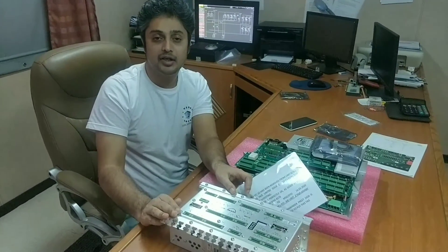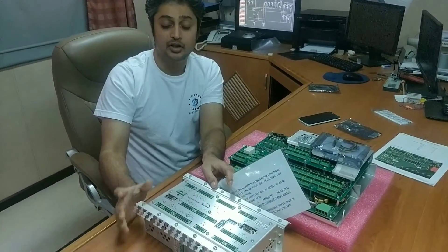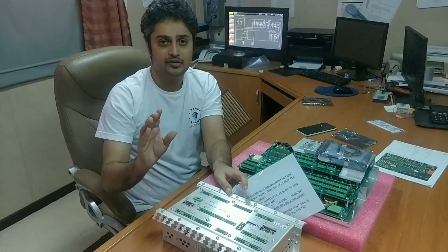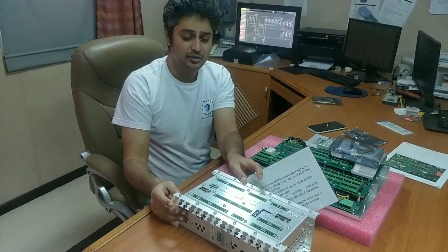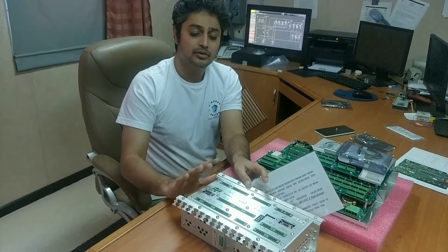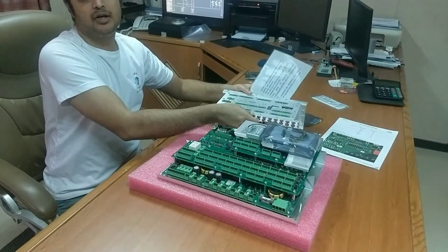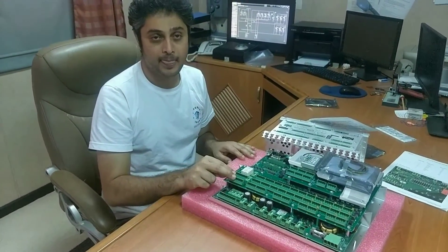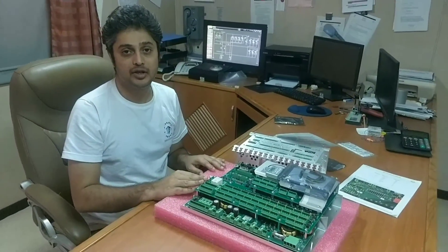What is the difference between MPC and MPC-10? MPC-10 has very restricted functions — it's only in the CCU. That's why it's compact, having only about 15 to 20 ports. It controls only four things: fuel injection, exhaust valve operation, cylinder lubrication, and starting air valve operation. But the standard MPC has about 50 terminals and can control about 15 cylinders. So it is a very complicated board — that's why it is more costly and its application is larger.